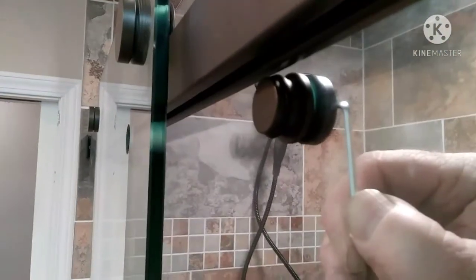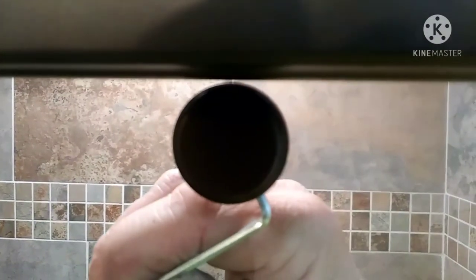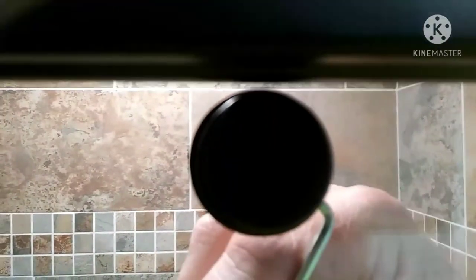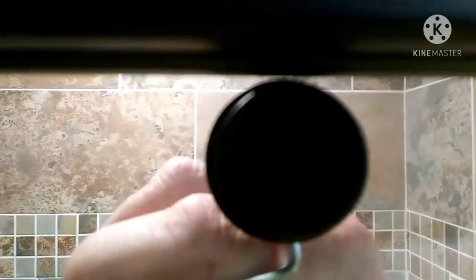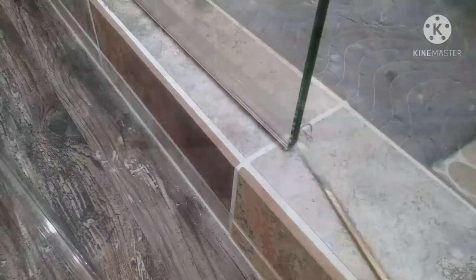These have anti-track jumpers — little wheels that go on the underside so the door can't jump off the track. There's very little adjustment on those; you want to be about a sixteenth of an inch away from the rail, then tighten them down. The side towards the shower head has little pins, and the shower rod goes on the outside. There are bumpers on the outside of each panel, and you need to notch around the bottom one so it'll go all the way down.